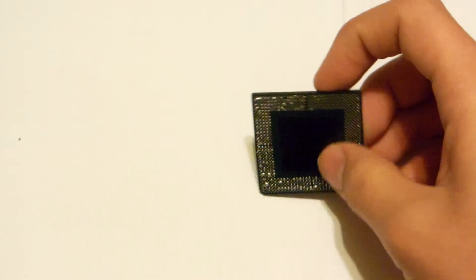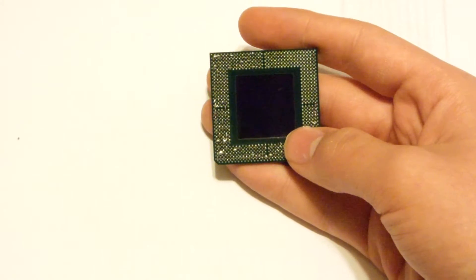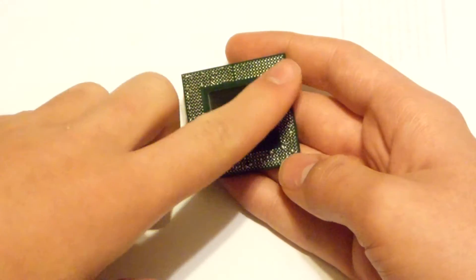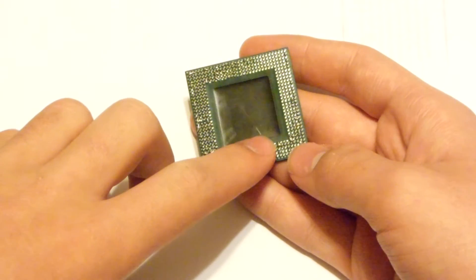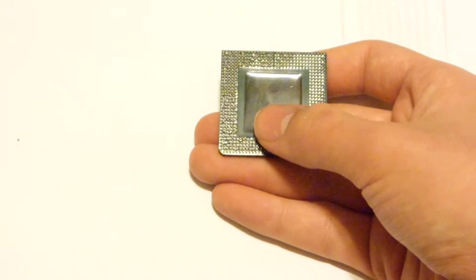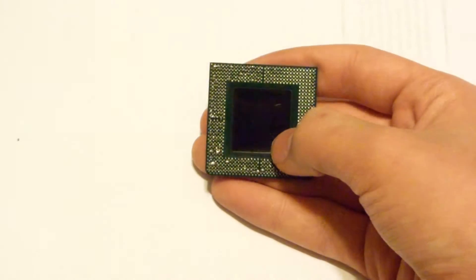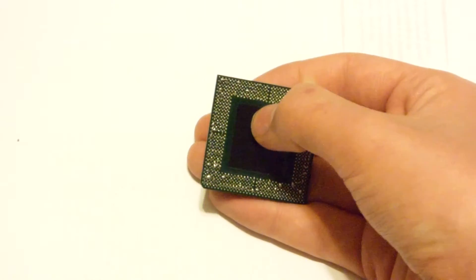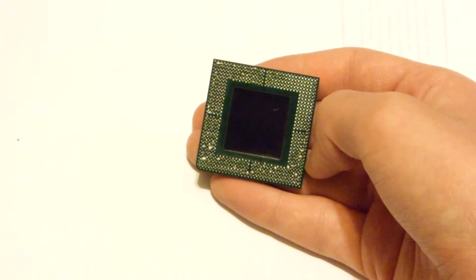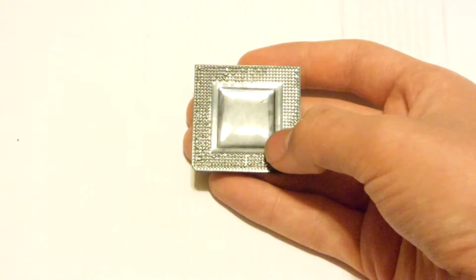On the bottom part, like if you've taken apart an MMX ceramic hybrid chip that has both a ceramic center and fiber outer edges — except this isn't ceramic, there's no ceramic in this one, but it's very similar. You'll find this thick black potting compound. It's very hard to break into, but it's best to use a chisel and hammer, like what is shown in one of Gio's videos.